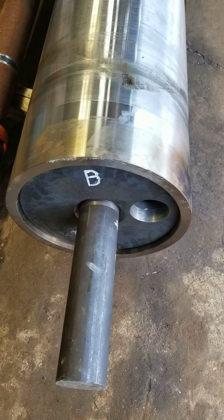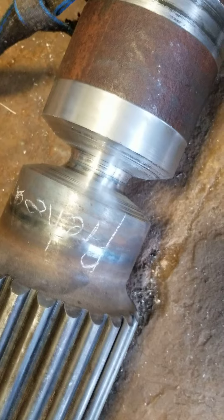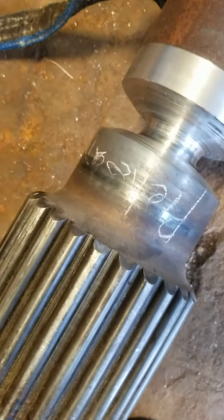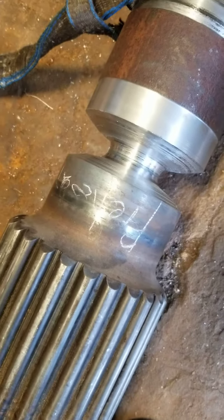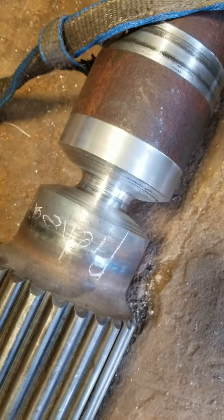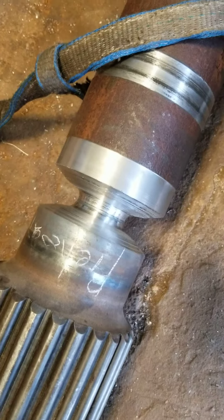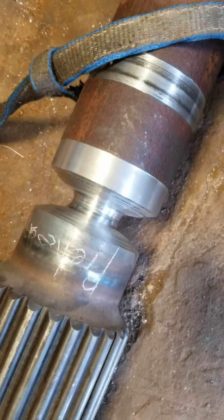And the one that I'm really looking forward to is this one. That's got to be solid weld. You see that preheat? That means that's alloy. So I got to preheat it and weld this piece of shaft to it.